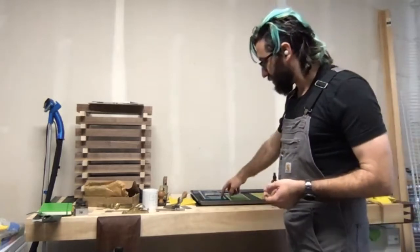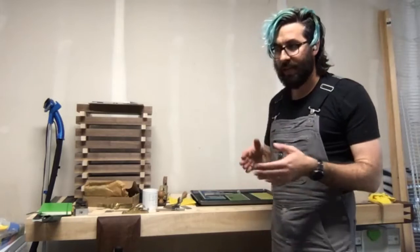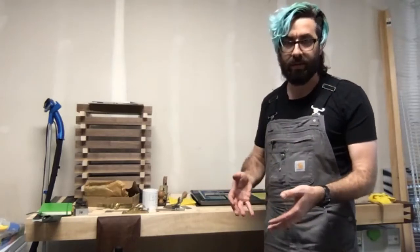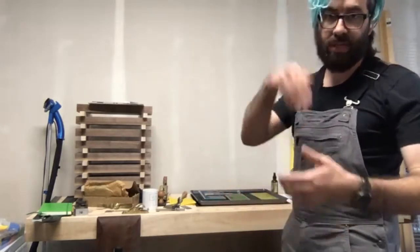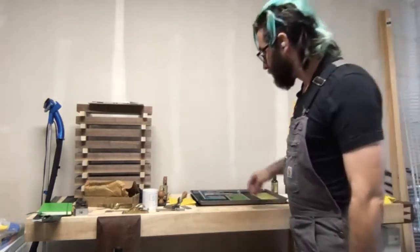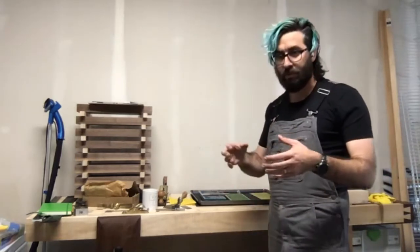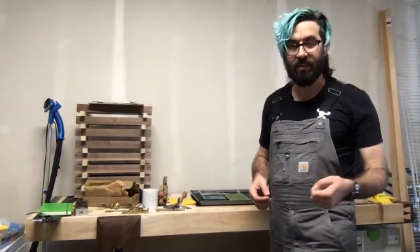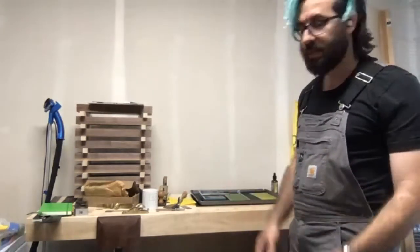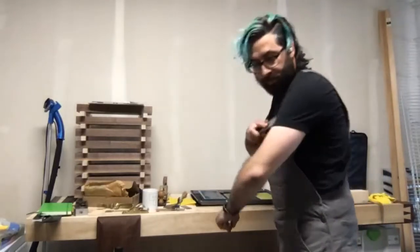The reason why the ruler trick is okay for things that go in planes is because the actual angle of attack doesn't matter. Whereas the angle of attack on your chisels really matters, because you're using that back half as a reference surface. So it's a great way to reliably remove the entire burr all at once, and not have to make multiple attempts. And I found it to be quite useful.